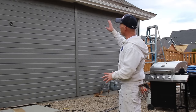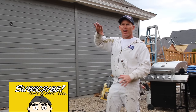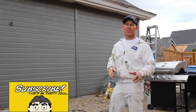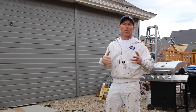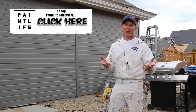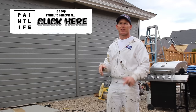Wherever you can when you're actually spraying these gutters, try to use some extensions so you don't have to get up and down ladders. Like this distance right here — I can just walk along the whole thing without very many starts and stops at all. Less starts and stops means less chances for spits, so the gutters will look a lot more natural, like a factory finish. You definitely don't want to brush and roll them because then you'd have brushstrokes all over them. Here I can just walk this whole distance without having to start and stop.